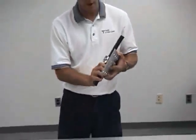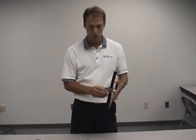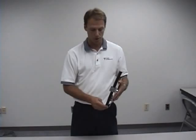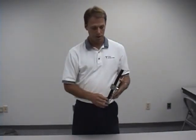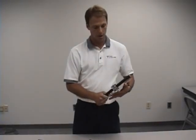It also has little gripper teeth in there. It's not designed to support the cable — that's the hoist grip's job. It does give minimal support, kind of holds it a little bit snugger to the tower and keeps it from slipping around. And that's about all there is to butterfly hangers.